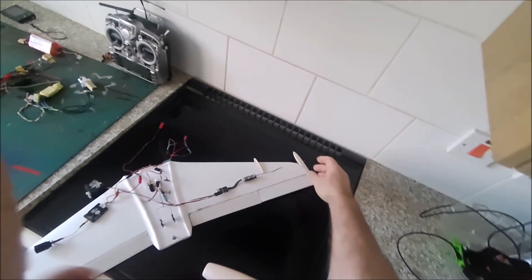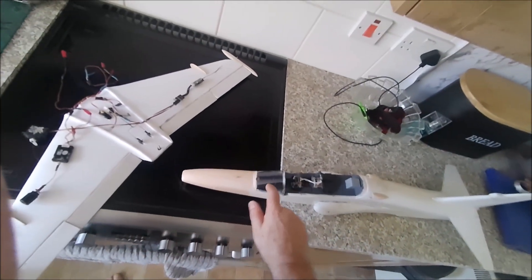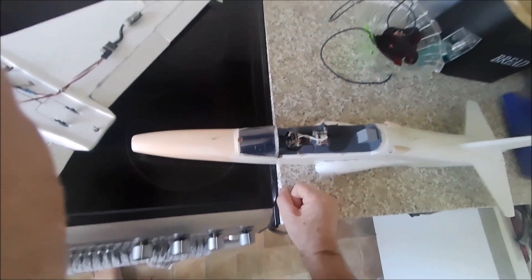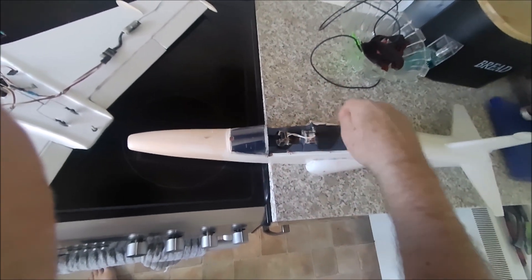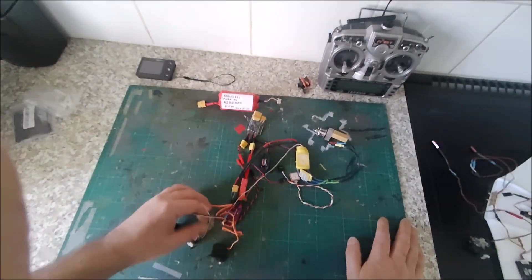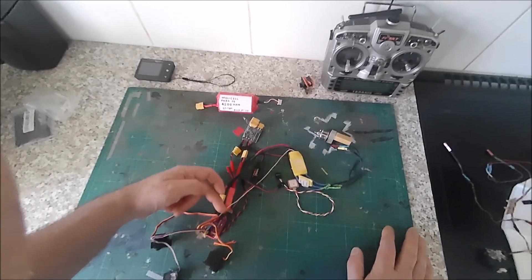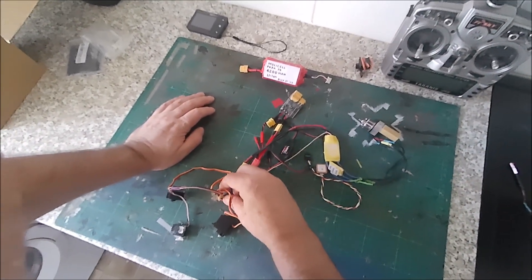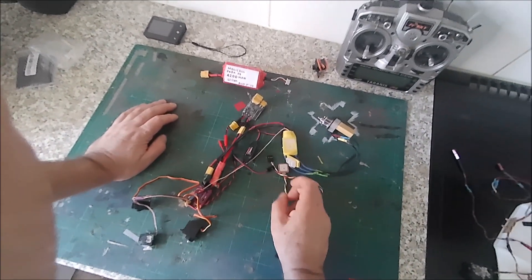I'll put these tips on here as well to match the T2 variant with the long nose. This is the PetG forward canopy so I've got a nice clear view through there. The rest of the canopy will go over there - I'm probably going to have to cut some holes in the side to keep it clear. I've got a UBEC which runs the board, powered from one of these cables from the main battery. I've also got the signal going into the same throttle port so they're all together, and that powers the whole lot including the throttle signal.